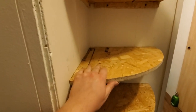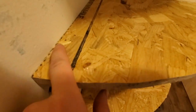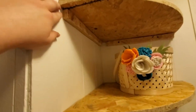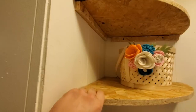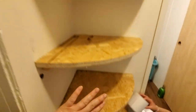If you want to paint these, make sure you sand them down before installing. When you put the nails in, use finishing nails about an inch and a half long — make sure they don't come out through the bottom, and go in at a slight angle with your screws in the back so they go into the wood without splitting it. As you go down each shelf, measure from the top down. Don't install the round shelf piece yet — get all your bracket pieces on first, then start with the bottom shelf and work your way up so you can get in to do your screwing and nailing.